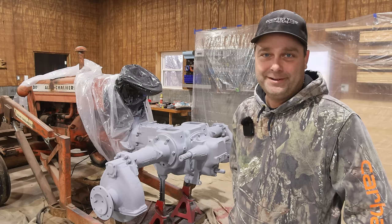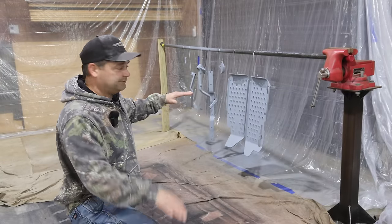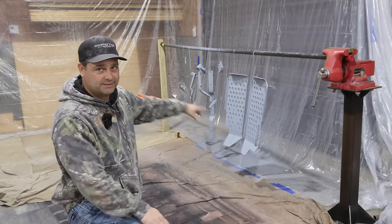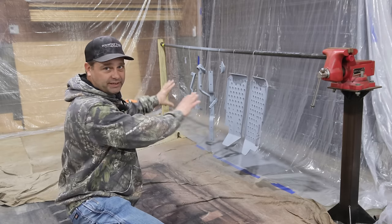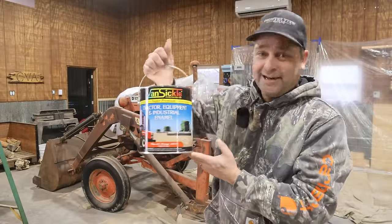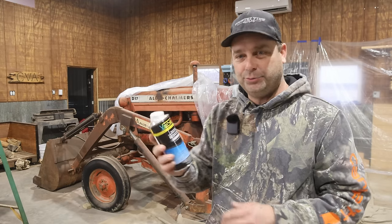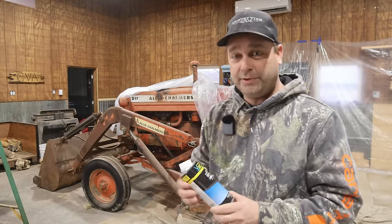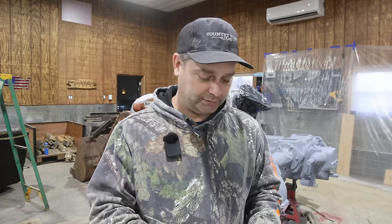It's all dry now and we're finally ready to put the orange paint on. I've got a gallon of Allis Orange and we're going to be using a reducer at an 8-to-1 ratio to make that paint thinner so it actually sprays through the spray gun. We're also adding a hardener - the benefits are that the paint is harder and more durable, it's also chemical resistant, and it will make the paint more glossy and shinier. Just like epoxy, you have a limited amount of time to work with this before it starts to harden - about two to four hours - so we need to have everything painted and cleaned up within two hours. You have to use lacquer thinner to clean up; paint thinner and mineral spirits won't touch it.